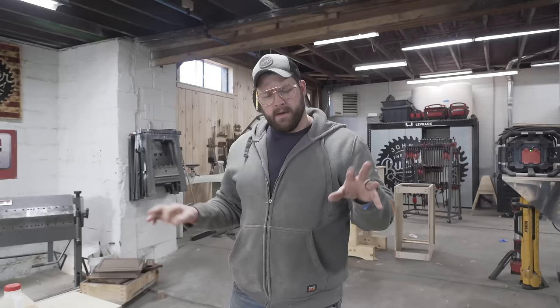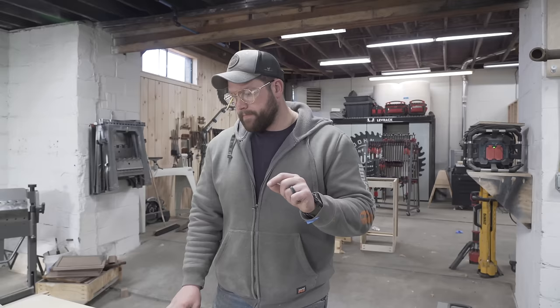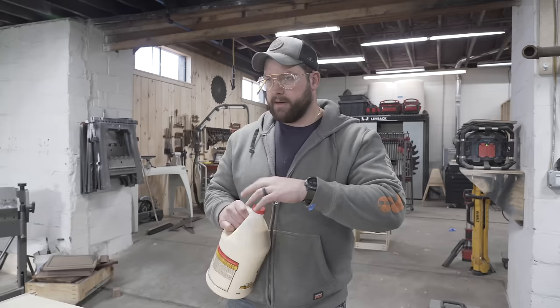All right, kiddos. So to make the best use of our time, I'm going to veneer up some shelves. I want the shelves to be white oak. You can't buy white oak plywood. At least I don't want to spend money on white oak plywood. So I've taped up a little bit of veneer. Gonna goop this on here, get it in the bag, and then we're gonna go work on the doors. Goop, goop. Goop. That's a real life sound effect.